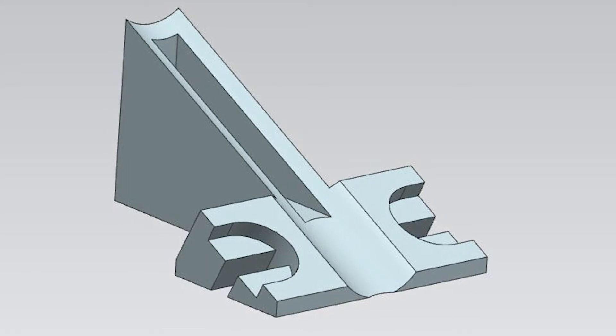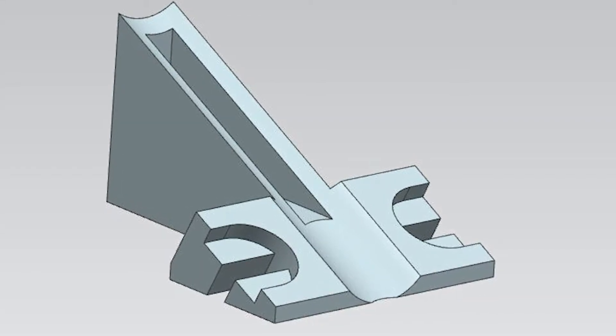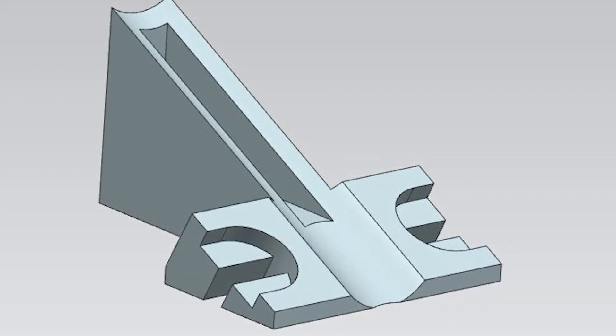For a shooting mechanism, we had a hopper and wheels attached to DC motors — like a baseball pitching machine throwing it down a tube. We designed a little ramp where we could attach PVC pipe and the two motor mechanisms, all in the same plane, so adjustments to the motors and the barrel angle could be made together. It would be fed by a hopper.